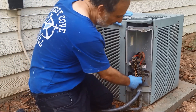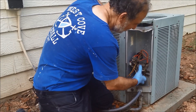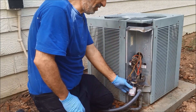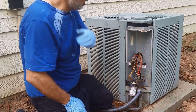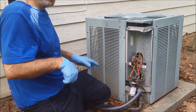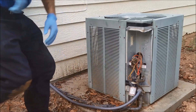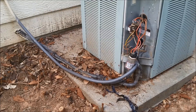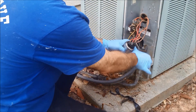You can see here, if you get close — here is the capacitor. That is the capacitor that I suspect has blown up. I'm going to remove it and test it with a capacitor tester to see if it's gone. But I know it's gone because I tried to start the fan — it didn't work. I had to push it with the stick, which means I gave it a manual push like a start-up capacitor.